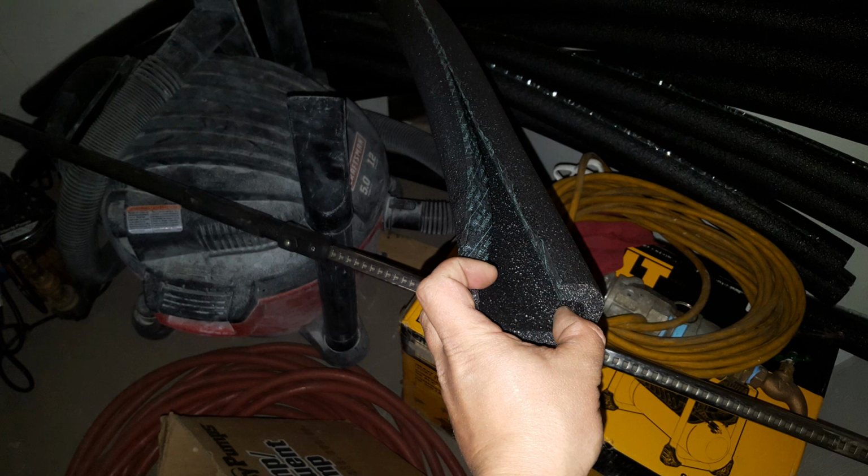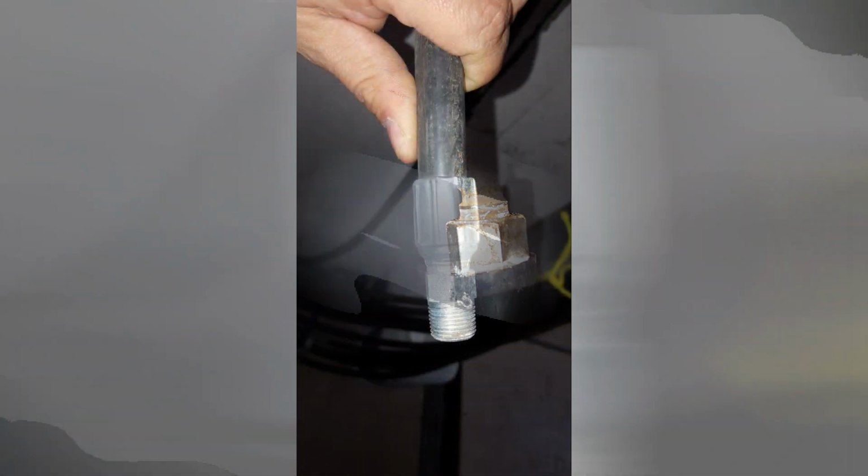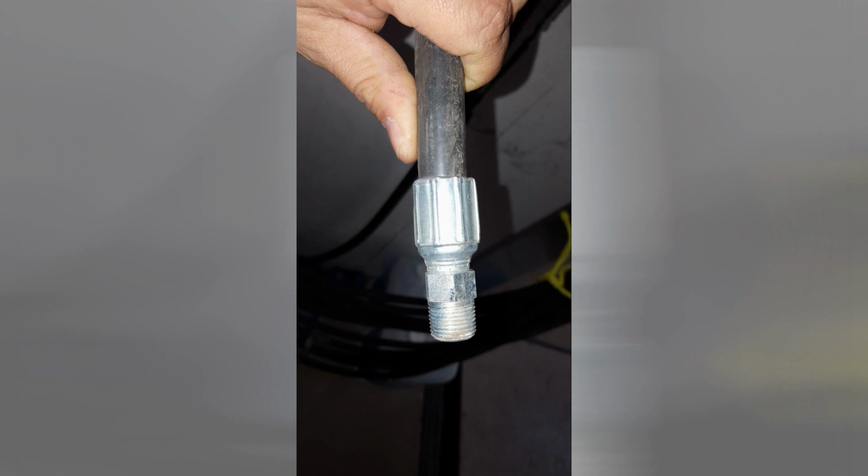Then you're going to want to get some pipe insulation tubing, the kind with the slit right down the middle, and it's pretty easy to put on and remove. What you'll use the pipe insulation for is to sleeve the 3/8 inch hose, wherever you're in contact with the customer's floor, because most of that high pressure hose does scuff while it's vibrating. So keep the damage to a minimum, throw the insulation on, and you can use Visqueen or anything else. Just be aware that most of the 3/8 inch high pressure hose does scuff. It'll help keep damage to a minimum.